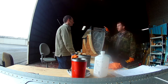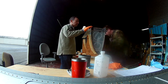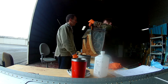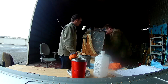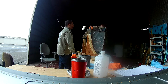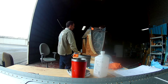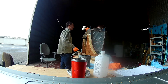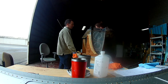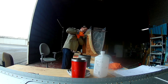Now, this is the only part that makes me nervous. The Z brackets are held on by pop rivets — you cannot get your bucking hand in there. Where are you going to get your bucking hand in? I mean, there's a gas cap, but it's just not possible. So we've got the pop rivet gun going at the top. The edges, thankfully, are still held on by dome head rivets. Something you should know about Michael: he's a very nice man who also happens to drive 777s for a living. Not only is he a commercial pilot, but he is also big into general aviation, which makes him especially unique. Most of the big-time pilots I talk to wouldn't know a Cessna from a Piper anymore, but not Michael — he's a cool dude. It was a pleasure having him here, and he already owned a squeezer, so he knew exactly what to do.